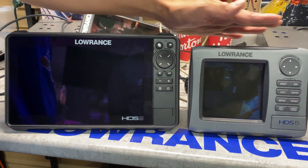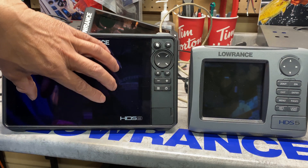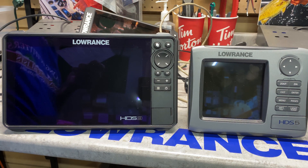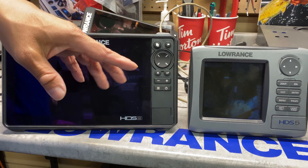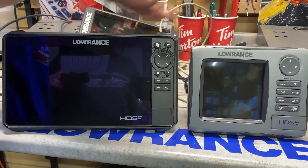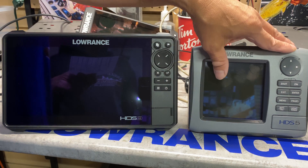If it's a budget issue because you have an older Lowrance unit, you can still network it, but you lose a lot of the good features that you paid for on the newer, fancier system. Legacy mode basically means the new system has to slow down and talk to the old unit, and you lose all the cool features of the new system because the old system doesn't recognize it. You will lose the dual transducer option on both units — it can only use the standard transducer — but you still have side scan on the newer unit. You also have issues with sensitivities and signal processing because of the processor speed difference, and it may slow down or jump when sending information from the back fish finder to the front fish finder.